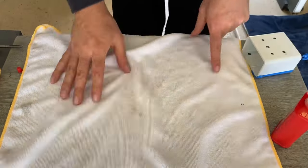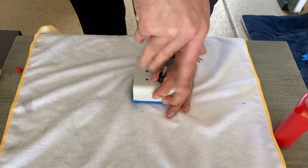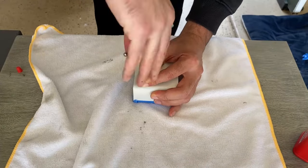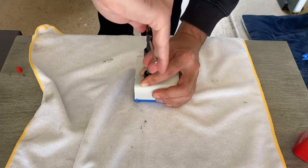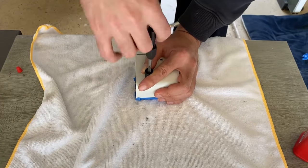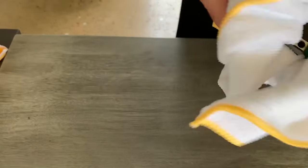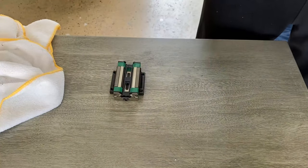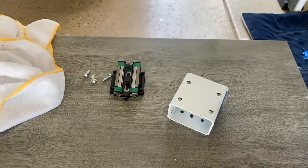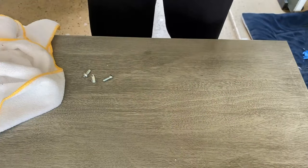I also want to point out that the large center hole in the middle of the roller isn't really needed. The joke in the Discord is that it's a vestigial tail — every build ends up having one, but it's a remnant of an older era of PrintNC. Once you're done with the rollers, you can mount your carriages. Make sure you clean and realign the wipers on the carriages before fully assembling everything. Essentially, dunk them fully in alcohol to remove all the packing grease they ship with, then put them on your linear rails and check if they ride smoothly. If not, loosen the wipers, move the carriage along, adjust, and retighten to realign everything properly.